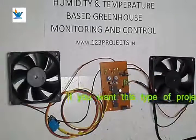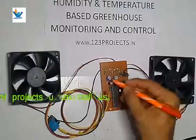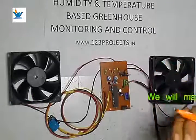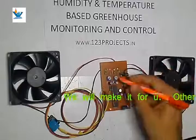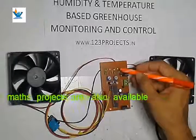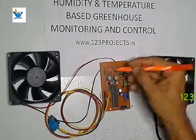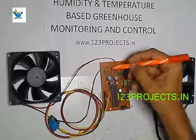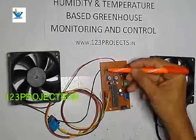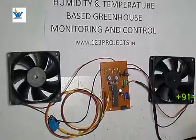If the greenhouse temperature or humidity goes beyond the preset level, the red LED will glow. If the humidity is more than the preset level, the yellow LED changes to a blue LED. So yellow is the normal condition for humidity, and green is the normal condition for temperature. If humidity rises above the normal level, the blue LED lights up and yellow turns off. Similarly, if temperature rises above the preset level, the red LED turns on and green turns off. These are visual indicators of abnormal conditions.